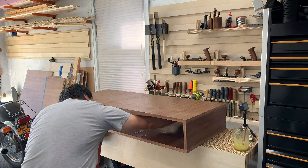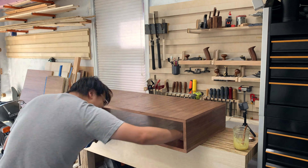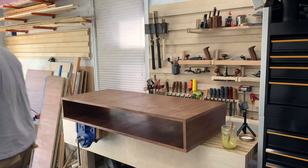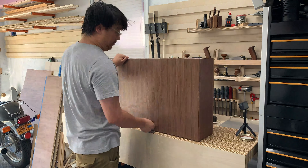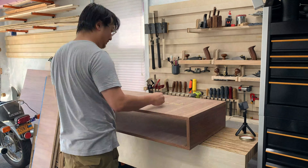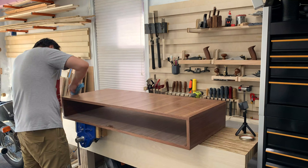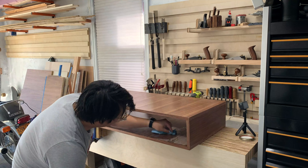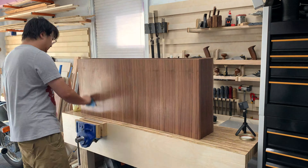What I'm using is a beeswax and oil mixture that I made years ago and I'm finally using it all up on this project. It's going to give a nice protective surface — the grain will pop, all the dark colors come out, and you can really start to see the shine of the protective surface. This process is actually sometimes enjoyable. It's a little dirty, but with any wipe-on finish it's a lot of fun — just wipe on and buff it out.